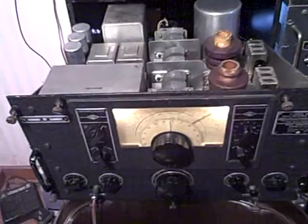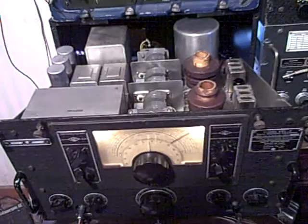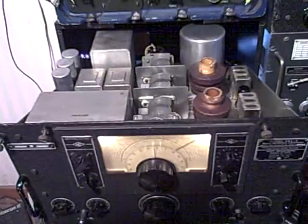I have an article I want to read about this particular radio receiver. It is a National product — it's an RBL series long-wave TRF regenerative receiver built for the Navy during World War II. The RBL uses a seven-tube circuit covering 15 kilocycles up to 600 kilocycles across six bands.